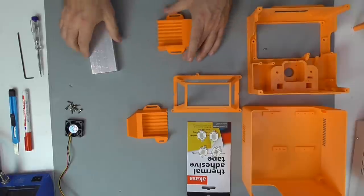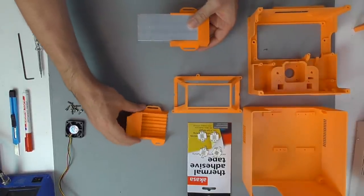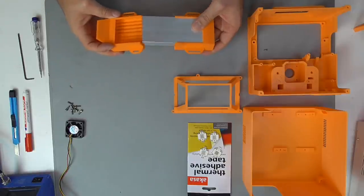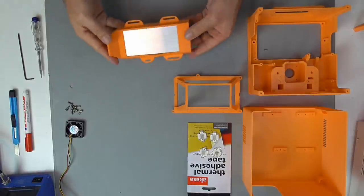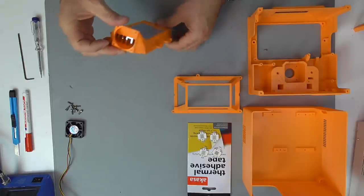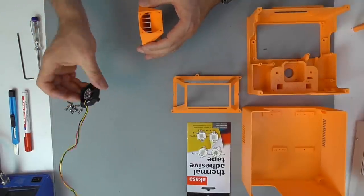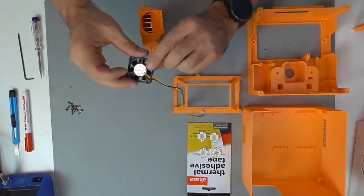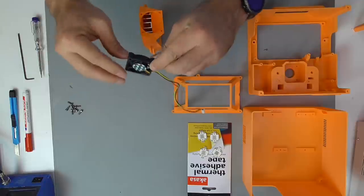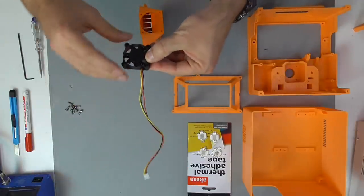Without a decent amount of cooling, our high power LEDs will become pretty hot, with the risk of destroying themselves or the other components. Therefore, our high power LEDs will reside on top of an aluminium heatsink, which will be placed inside an air channel, which has 2 open ends with a fan attached on one side. That fan will pull in fresh cool air from one side and push out the hot air from the LEDs on the other side.